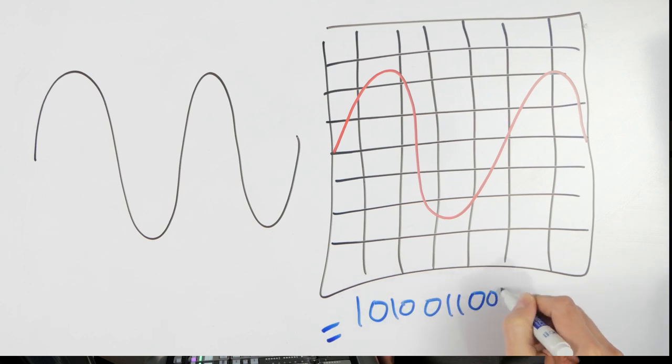Digital consoles just have an analog-to-digital converter right after the preamp. The analog-to-digital converter takes an electrical signal and turns it into ones and zeros. It's important to get this level right, because if we don't use enough level into the converter, we're going to be missing some information and lose some detail. But the thing you really want to avoid is digital clipping. This is like you zoomed in too far with your camera lens and cut out your Aunt Doris in the family photo — there's no amount of Photoshop that can get her back.